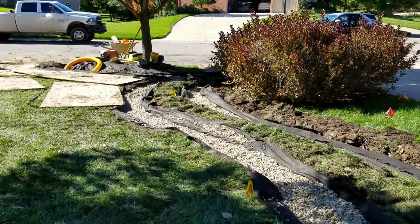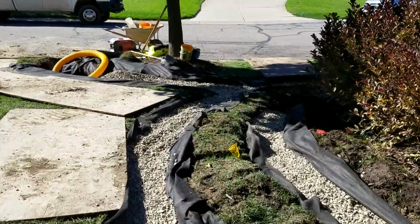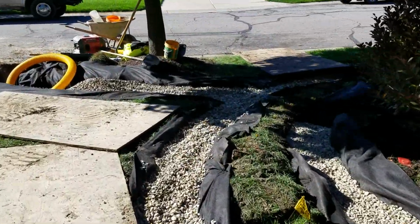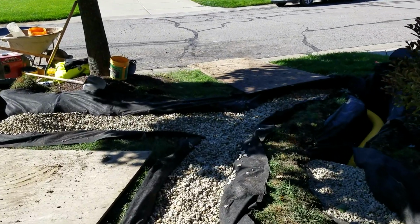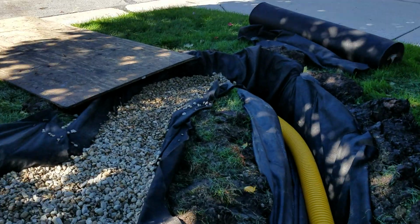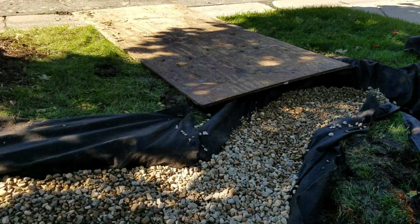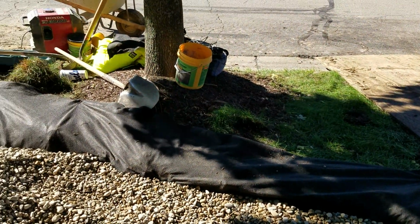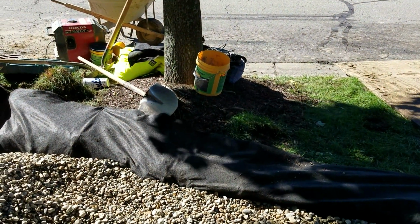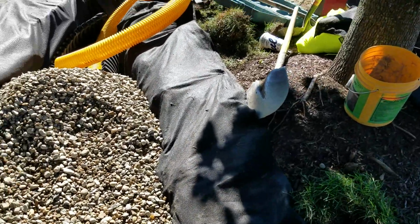It's not a problem. Hide the utilities. You know, we can just put in a French drain like you see here. So we're running the parallel drains because this area is so flat and wide that one drain wouldn't be enough. We had to run two. And there was a low spot here. We wanted to grab up all the water. Now in previous videos I talk about trees, how they lift the ground. That made it worse too. So we have all these elements working against us.